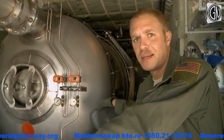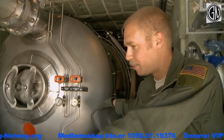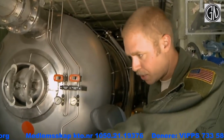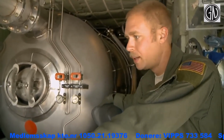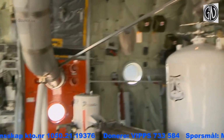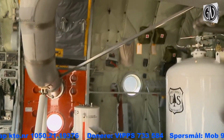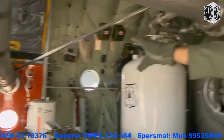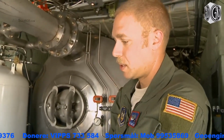It's one big contained unit that just fits inside the airplane with additional tie-down chains that we use in addition to the restraint rails that are provided on the airplane. And we assemble the parachute door plug, which is where the vent tube, which is this that comes out. This allows pressure equalization within the system. And then we install the door plug and then install the S-duct on the outside of the airplane, which you can see.